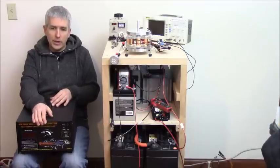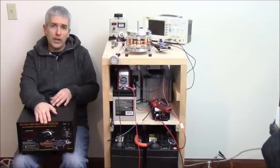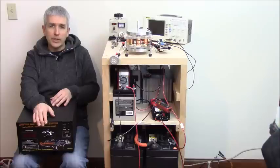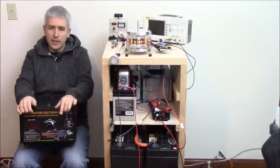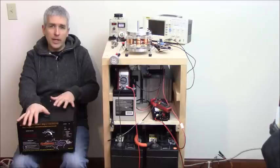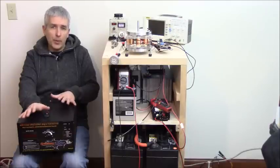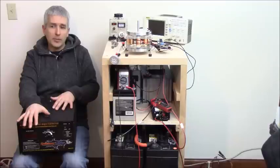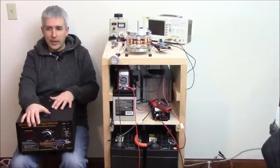So we've been doing this. We've been selling these chargers for 12 years commercially all around the world, in which this unit, for example, is our industrial model 3812, RC3812, and it does your small, medium, and large 12-volt batteries. This particular one is just a case, and the label is showing a 24-volt model. So we have 4 models of this, either 110 or 220 input from the wall, and either 12 volt or 24 volt only. There's no 6 volt or 18 volt, and you can't charge a 12 volt battery with the 24 volt model because of the transformer hookup and all that, and the programming.